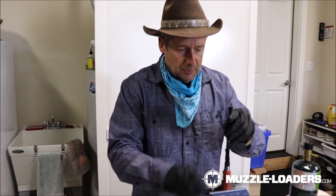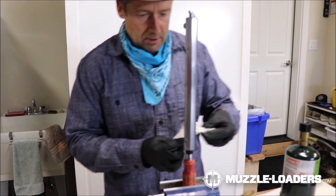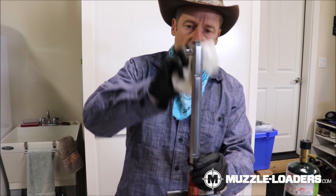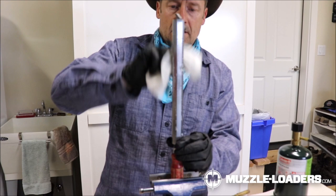What I've done now is put some duct tape around the shaft of the screwdriver. The screwdriver is going to allow me to put the muzzle first down on the screwdriver shaft, and now I'm going to wipe down the barrel with this mild detergent. I've sanded the barrel with 150 grit and with 220, and now we've got the barrel in the condition I want it. But now I've got to degrease it — that's what we're doing now — degrease it while we get ready for our plum brown.